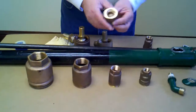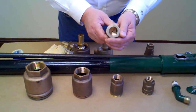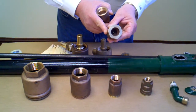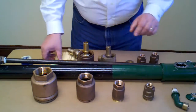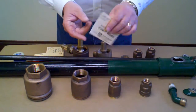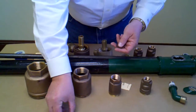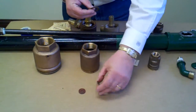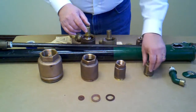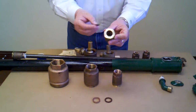The inner valve body looks like this without washers, and we have a valve packing ring that threads in to keep those washers in place. This is what a valve body looks like when it's repacked with new washers. When you get washers from Murdock, you'll see a washer kit with a seat cup and ring washer — they're made out of tan leather. There's your seat washer, there's your cup washer with a beveled edge on it, and there's your ring washer. All three of those washers are located in any one of these valve bodies. Three-quarter inch will have a screw in it that holds the seat washer in place.